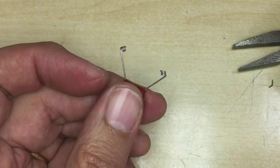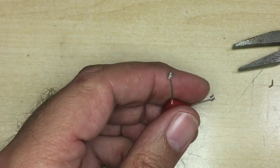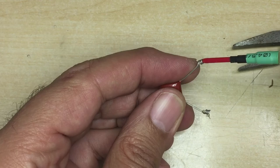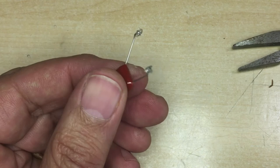So I've got two little pigtails on the end of these two points. I'll just straighten them out. Now I'll squirt a bit of flux in there, and my component is now ready to go in over those two points — those two little pieces of the original component that I've left in the circuit.